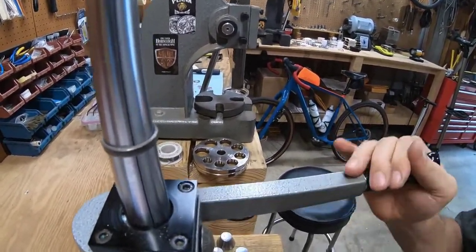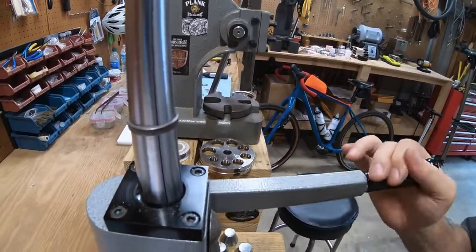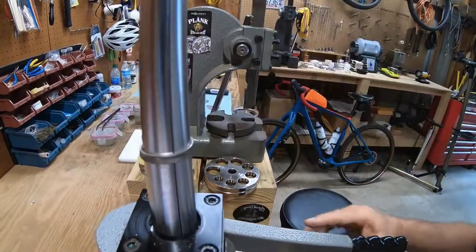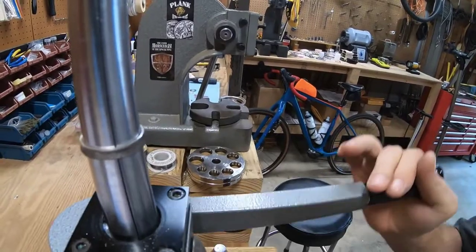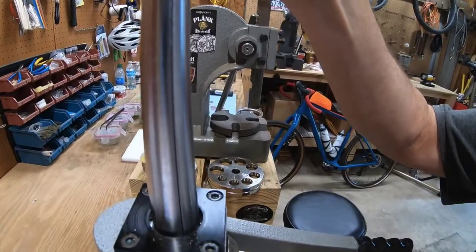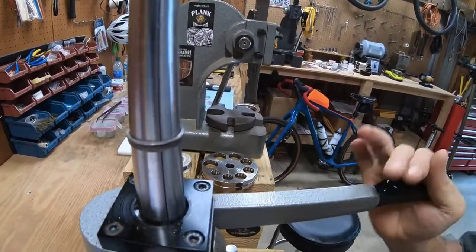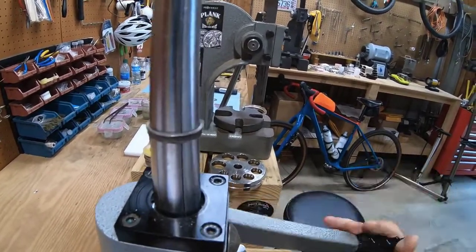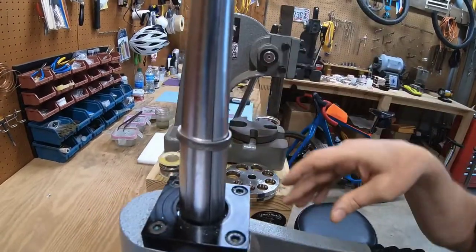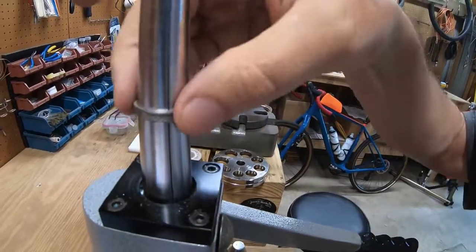Basically, I'm stretching about half the ring at a time here instead of the entire ring. I could probably stretch this thing up to a size 18 if I really wanted to, just by continuing this process here without splitting it at all. Now, if I do that without any protection on the inside like I'm doing now, I'm probably going to destroy a lot of the detail on the inside, but you can get these things up pretty big just by doing this.